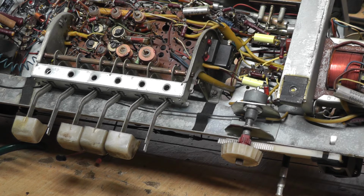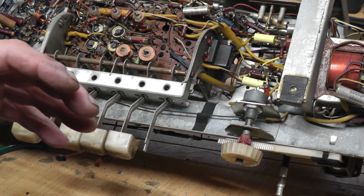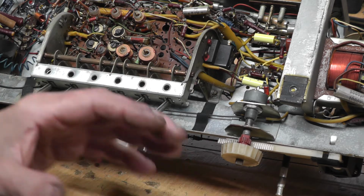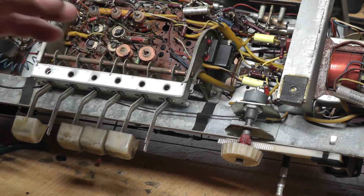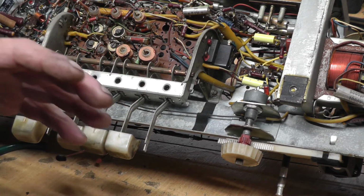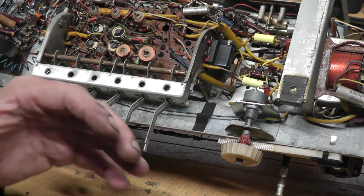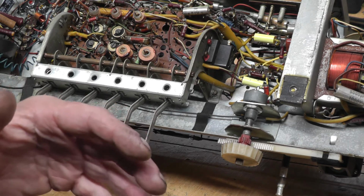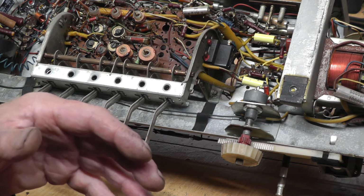And you can't go too far wrong then. You can still solder it on the wrong tag or get the tags mixed up, but that's why I say it's so important, or really a value, to have some video or pictures of the set before you start, because if you do have problems thereafter, you can go back and have a look at that and start to think.